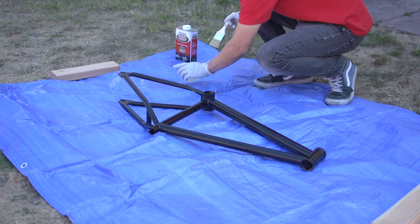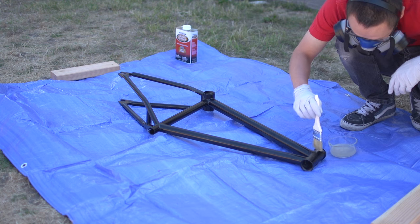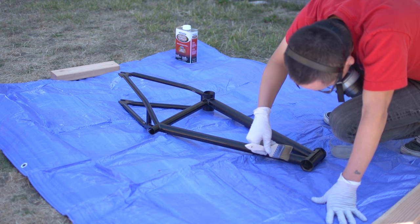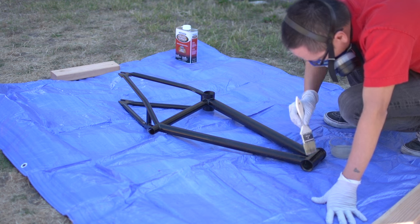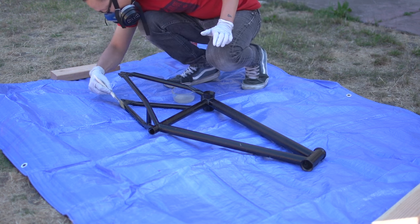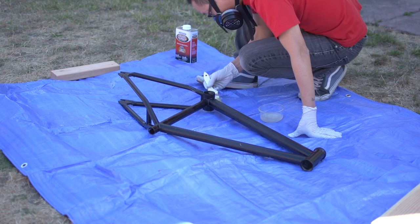Using aircraft remover is pretty straightforward. You just brush it on, but as I eventually realized, globbing it on works best. Use a lot. Once it's on, it only takes about 15 minutes and then you can start scraping. I only covered the parts to be recycled and I started out by just doing one side, although in retrospect, I wish I covered both sides from the beginning.